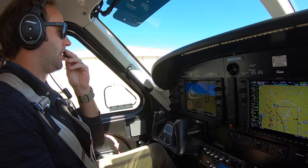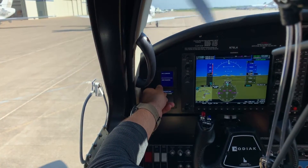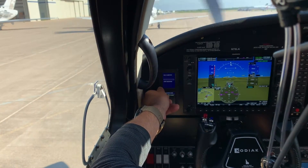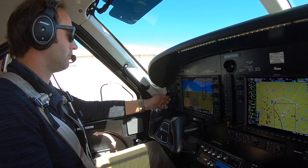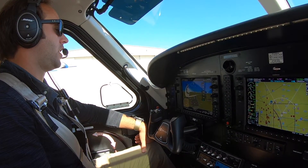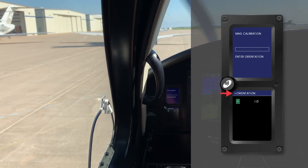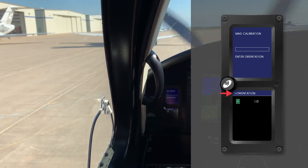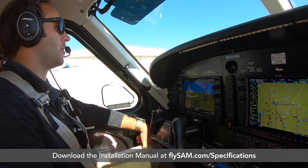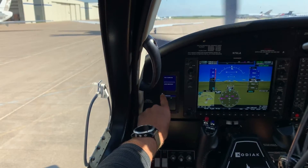So we're going to put in this offset, and where we are is about 65.460. And then we're going to put in the orientation. The orientation is how the magnetometer is installed — is it flat, or is it on its side? There are pictures in the installation manual to tell you exactly what orientation it is in relation to the ground. So we're orientation number two.